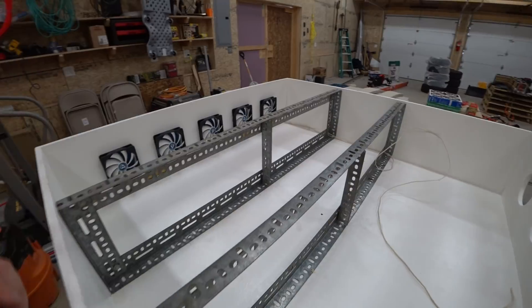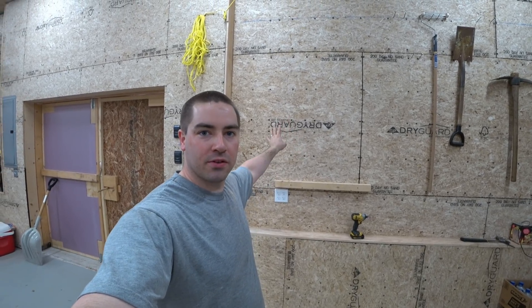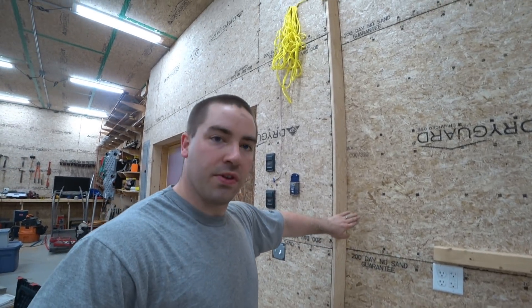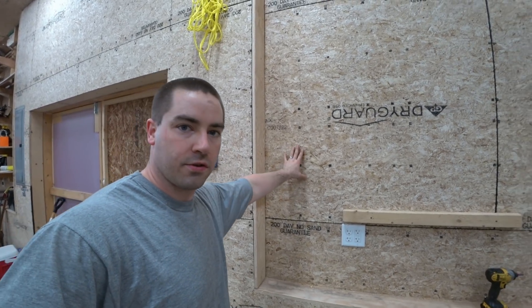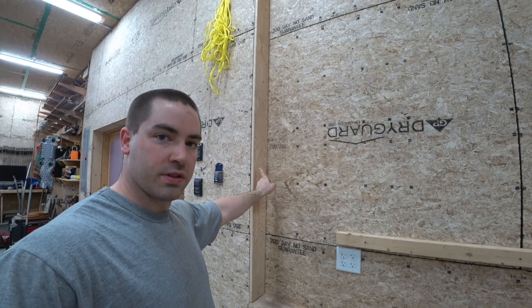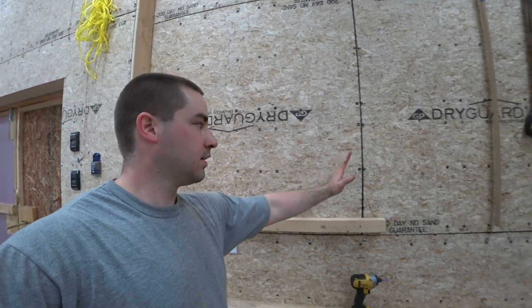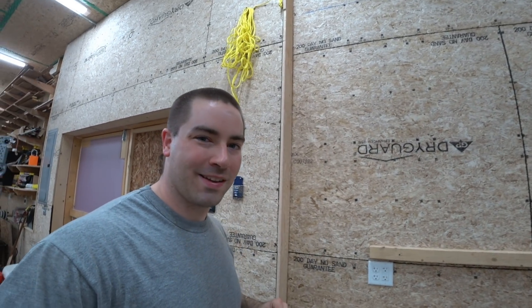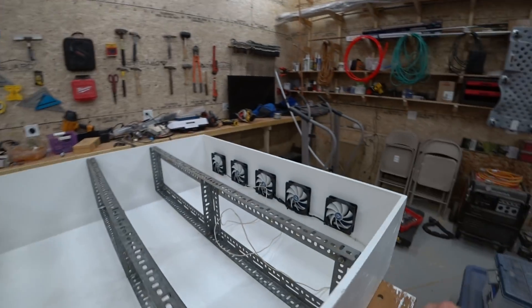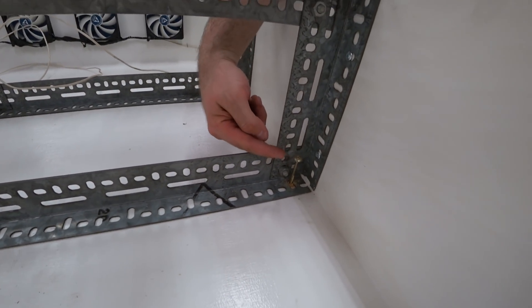The cabinet is going to be mounted to the wall right behind me. My studs in this garage are 24 inches on center and that box is 48 inches wide. There's a protrusion here where I went to a double stud versus a single stud — there's another stud behind here — so I'm going to be able to screw sideways into this one and grab three studs total to help hold up this very heavy battery along with the inverters. I've already put in some number 10 screws, three inches long.